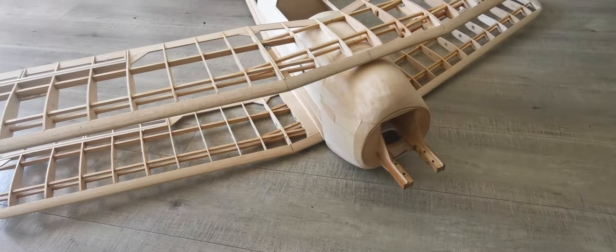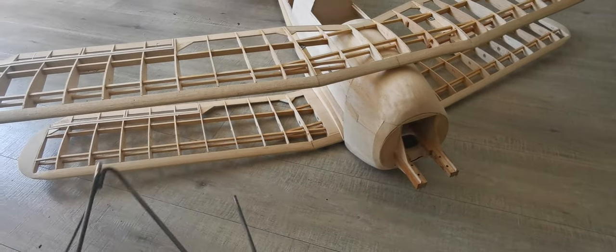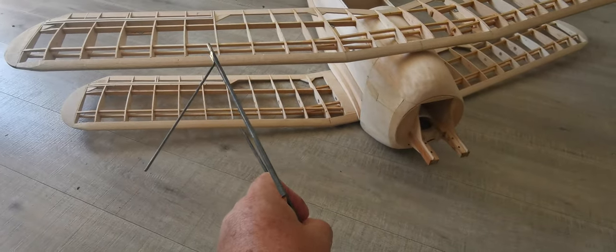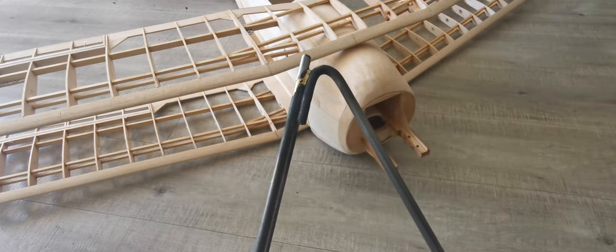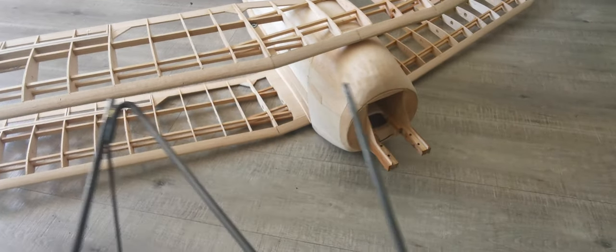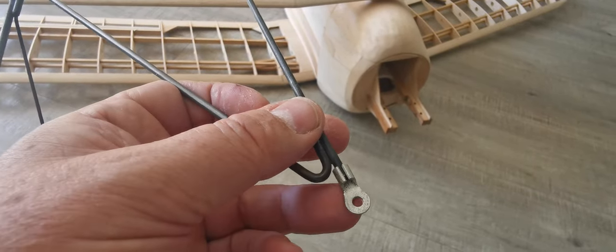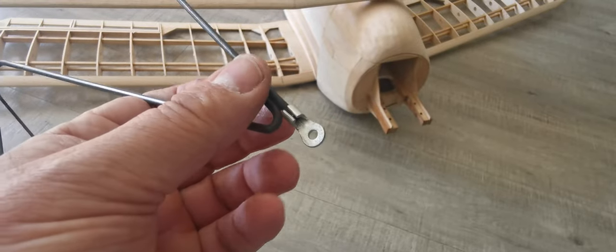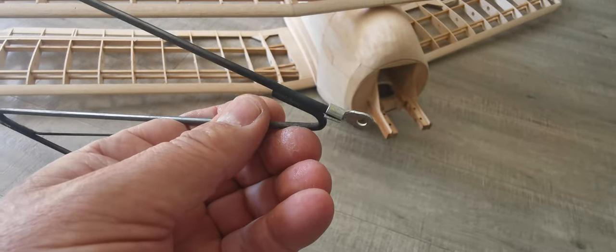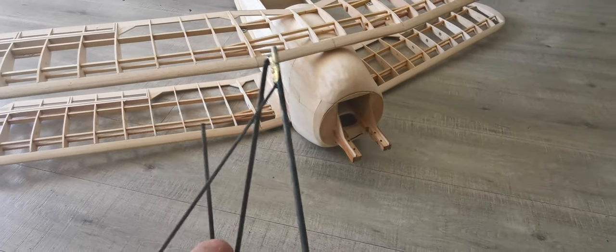So I need to make the jig first, and then once the jig's made, a lot of the hard work's been done. These have actually been brazed together, so they're going to be extremely strong. These will be soft soldered on initially — I'll have a good check of them, and if that's not good enough, then perhaps they'll have to be silver soldered.